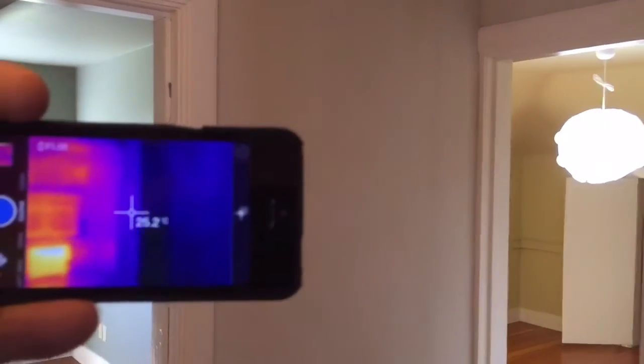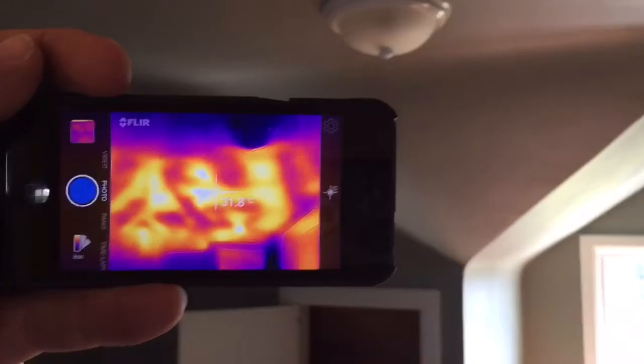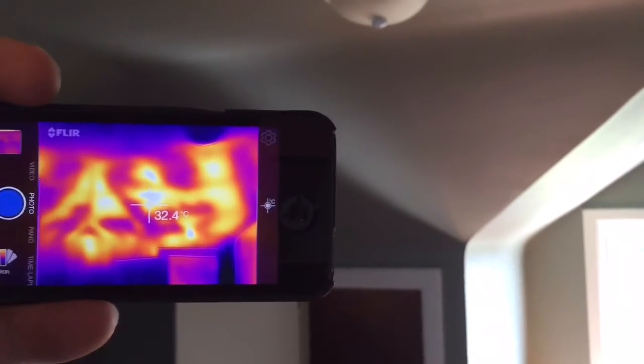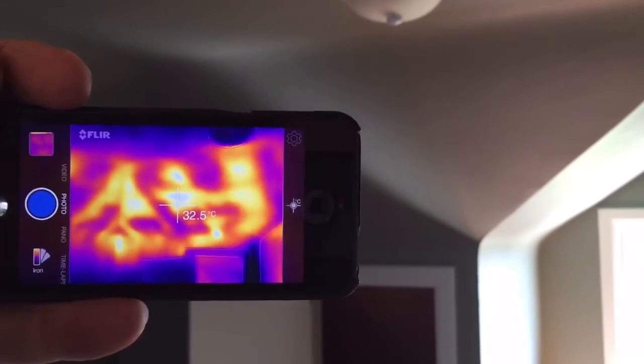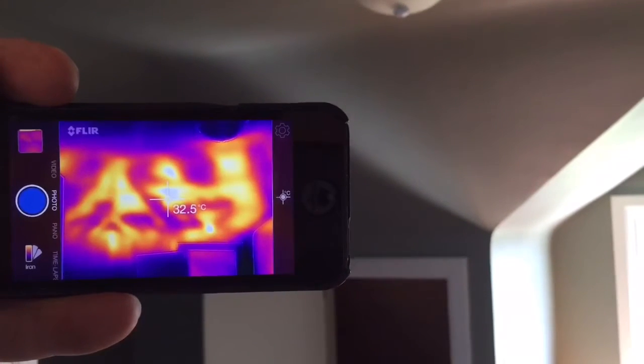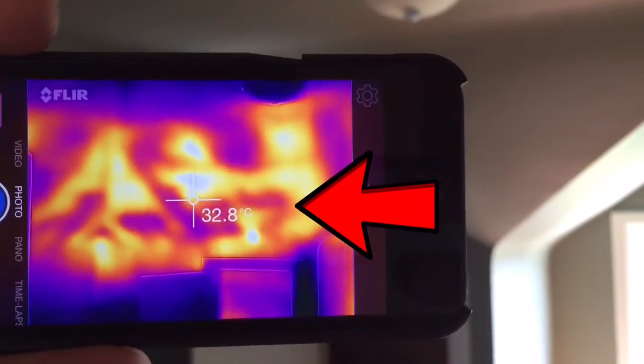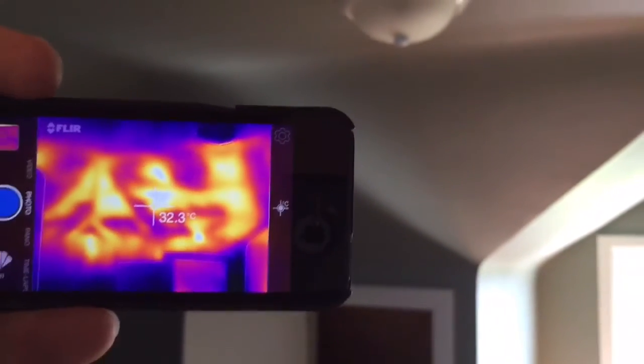It's so important when doing an inspection to have at least a FLIR-1 infrared camera to show you differences in temperature. The vaulted ceiling actually has insulation in very patchy areas. The orange light is actually where the heat is getting through into the home. It's obviously summer and 26 degrees outside. If you look closely, that roof is actually 32 degrees Celsius in those areas.